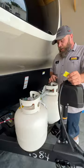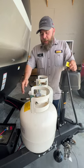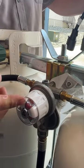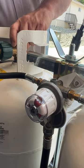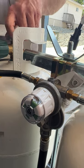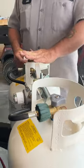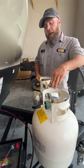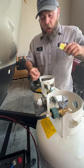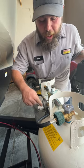Next, back behind that is going to be our two 20-pound tanks. These guys have both been filled, minus the propane that was used to test the system. This guy here is going to be your regulator. It basically tells us the status of the tank and would let us know when the tank is empty. Right now it is reading red because we have no propane flow. As soon as I turn this guy on, it flips over to green, showing us that we have propane flow. This system is designed so you can actually have both tanks on — once the one tank has been emptied, it will start drawing from the other tank. There's actually a little notch on this guy here to show you what tank you're actually using.